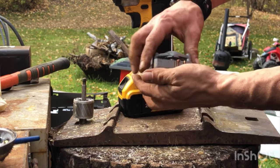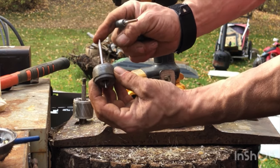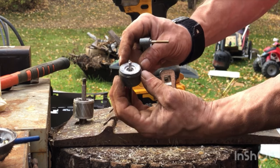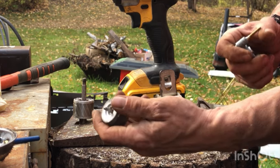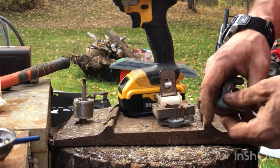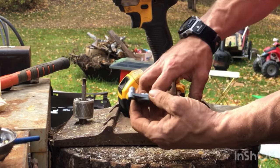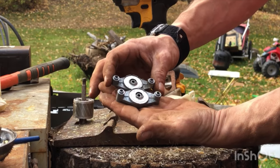I just want to separate the motor shaft piece. Your fan blade would be attached to this. Now there is some aluminum on the outsides of these, and then there is a steel, but not really worth your time trying to cut that little bit of aluminum off those ends. I'd just throw those into shred, or possibly, depending on your yard, a prepared. The end pieces here that held that in, they are a cast aluminum.